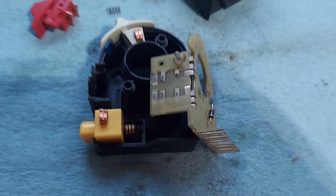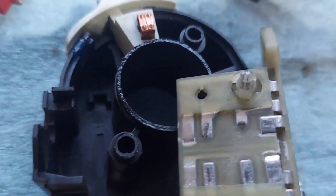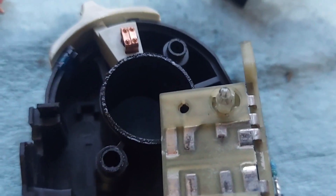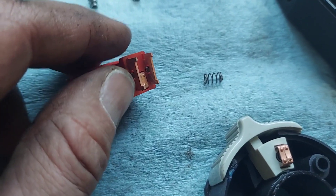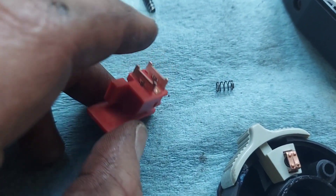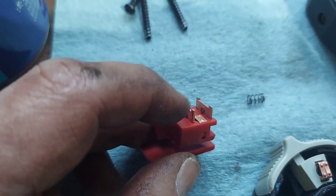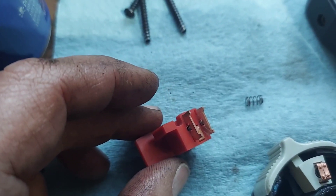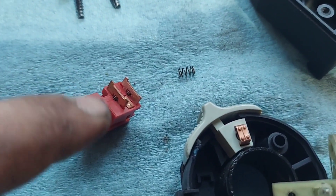Got the switch off at the bench. I only had to back that Allen off a couple turns. I got this apart, and it's going to be fun putting it back together. I noticed a little bit of crap on those contacts. But what I noticed is one of these was stuck. One of these would, when you push it in, it would stay. So I took it off and sanded it lightly, and now it goes in and out smooth.